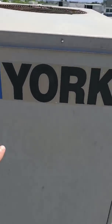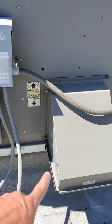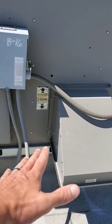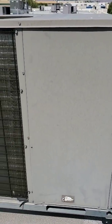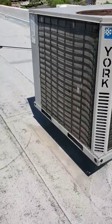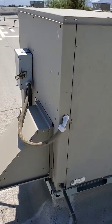I'll show you what we're going to do. This compartment here is where your compressor is. This one here is where your filters are. This is your supply and that one's your return air, so we'll be checking those two. Make sure we get the 20-degree split, because that's what you need - so if it's 75 inside the room, you want a 55-degree supply. This is all your electrical - probably your contactors and stuff like that. Your condenser fan motors are up there and compressors are inside. I'll show you exactly what I do for those of you just starting off who need an idea how to approach commercial equipment.